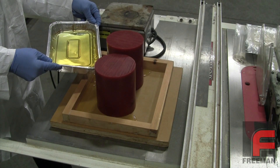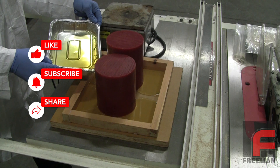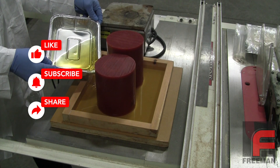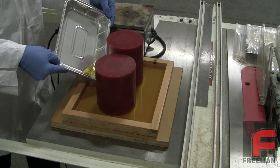Alternatively, you can pour the wax into a small basin around your machinable medium, as you see here, or if the medium doesn't have a flat bottom, you can place the medium in the molten wax itself and secure it until the wax sets up, which it does fairly quickly.